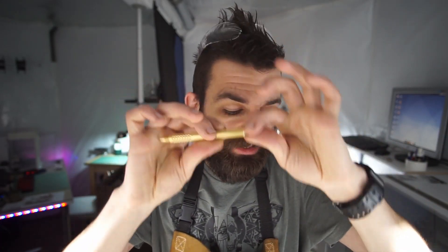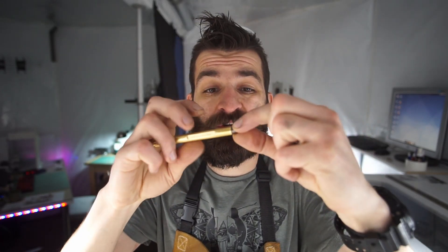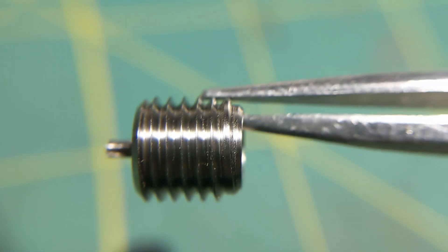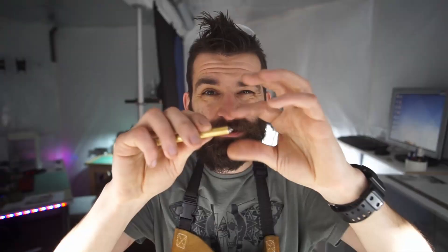This is the first little titanium one I did. Then I did two more, just slowly dialing in the thread. The way my threading tool is — it's a sharp point and most threads have a rounded or flat bottom to them. I also had to go a little bit deeper because these weren't quite going in. But this one works with all the tolerances dialed to basically match the original, without a go/no-go gauge. It's about the same feel — a little more sloppy than I like, but I want it to be compatible with all my previously built pens.